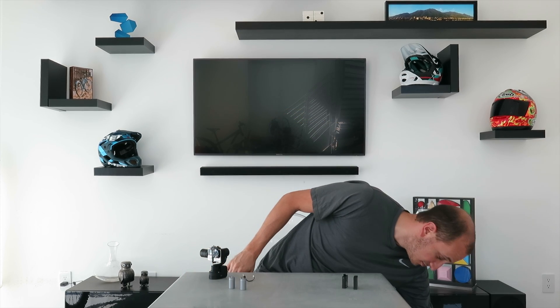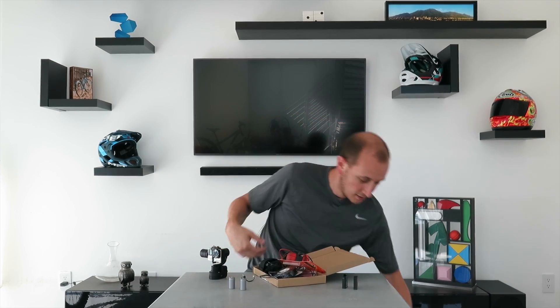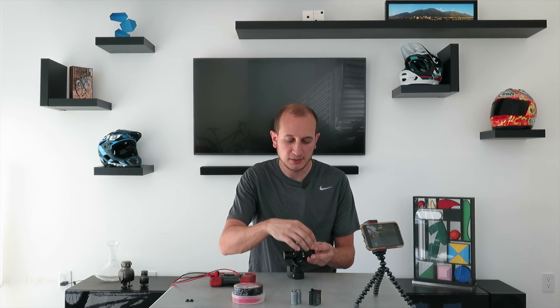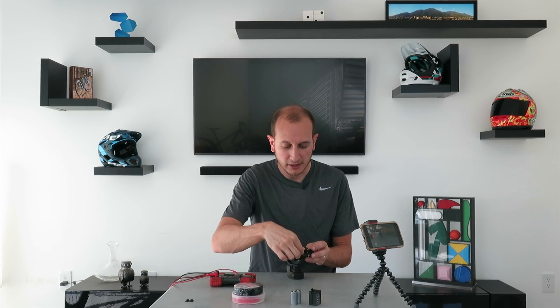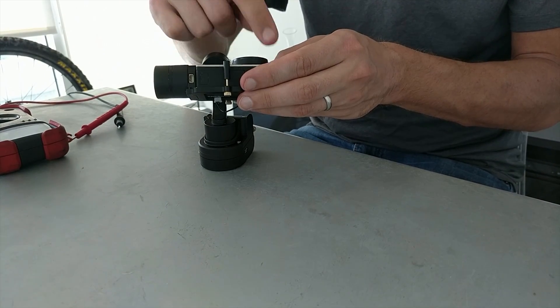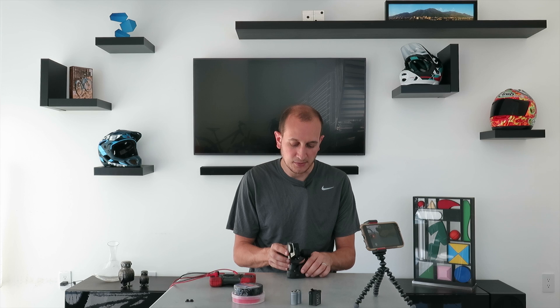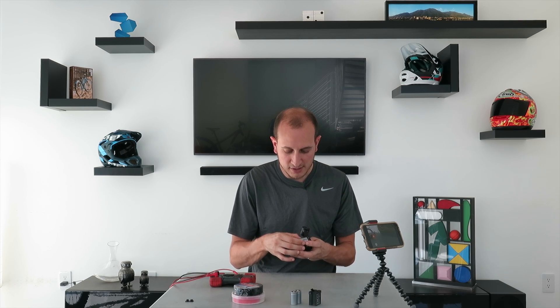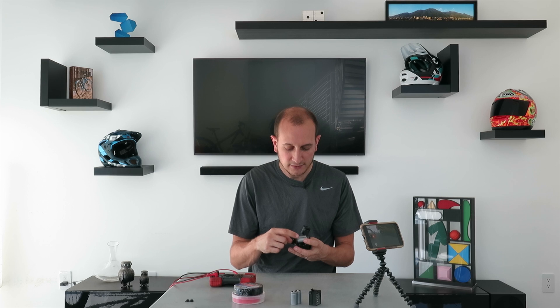Instead we're gonna have to use all this stuff together to hack together a battery pack for this. We said we're gonna use this cable, run it through the bottom and plug it into this port right here to provide power to the GoPro. Since we can't input power through the USB port, the only real option we have left is to find a way to get more power in through the batteries. In order to do that, we have to understand how this actually works, so the first thing is to figure out how much voltage is going in there. We know we have two 3.7-volt batteries but they can be connected either in series or in parallel, so that's something we have to figure out.